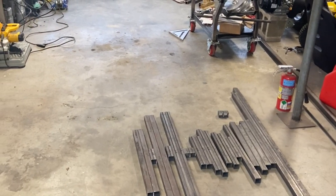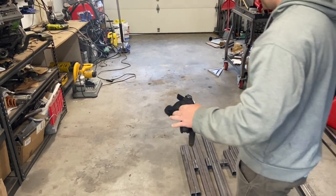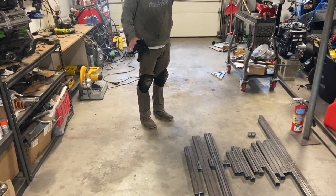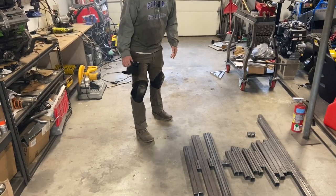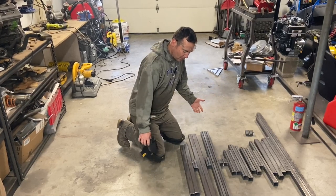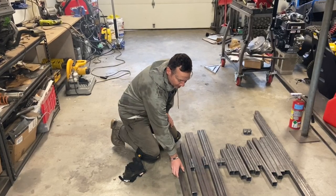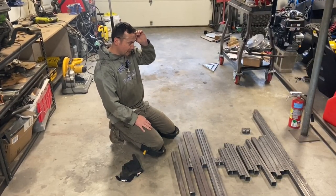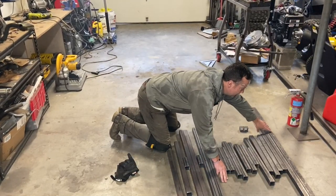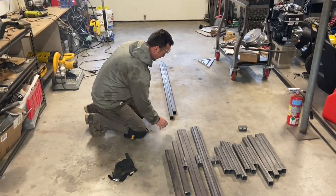If you're a first-time builder or you've always wanted to build something like this and you're intimidated, don't be. This is not incredibly difficult to build — it's actually kind of easy. You start with the jig, which is square tubing. All you do is measure it correctly, make your ends cut nice and square, and it's easy to assemble. It's a great way to get started in a build like this. Starting out, you're just taking your pieces and making a big square.